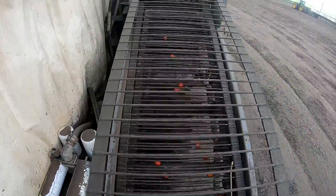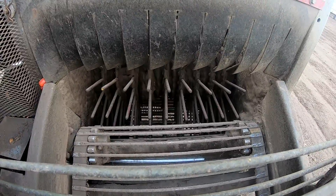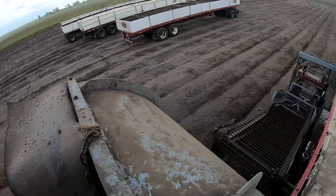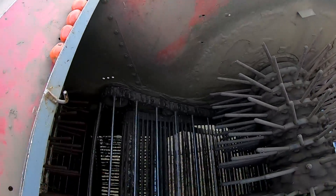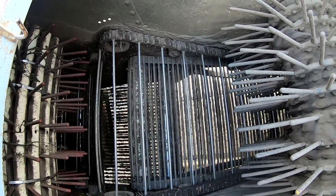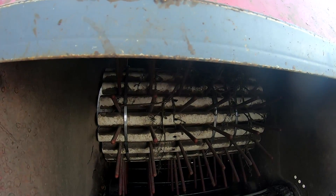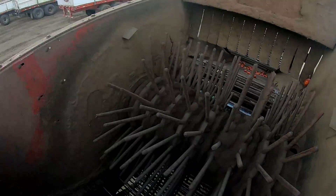You can see all the little fingers everywhere, and it has a counter-rotating weight box underneath that tarp there. There's the brush, and if you look down in the chamber here, you can see a bigger chain where tomatoes fall through and a smaller chain that catches them and dumps them onto what's called a rear cross. And that is the back brush — we call it the secondary. It shakes off some of the leftovers we call hitchhikers that the primary brush doesn't quite get.